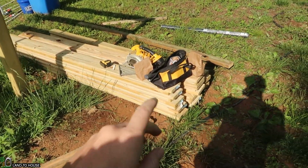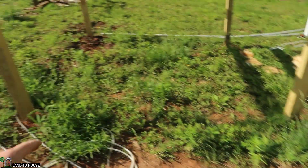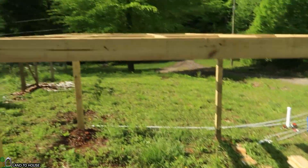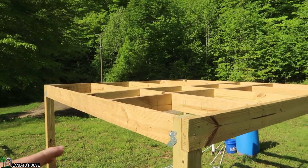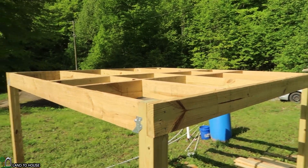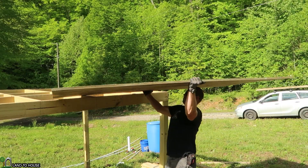The lower deck is going to be composed of decking boards, which are five and a half inch by about three-quarter inch, and that will be down here on the bottom of course. The top is going to have two different sections — five and a half feet of treated plywood, and the other half will be decking boards as the front porch of the Playhouse. This treated plywood is painfully heavy, so if you have somebody to work with you, definitely use them for this step.